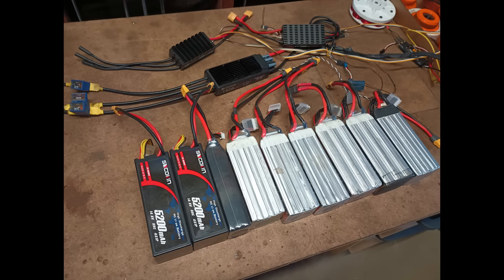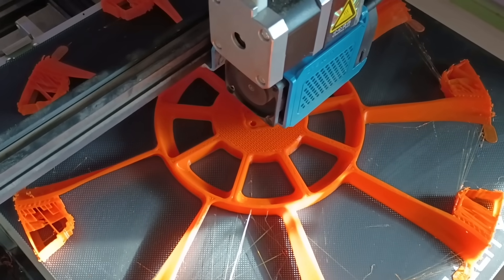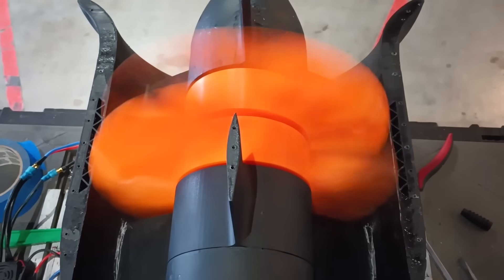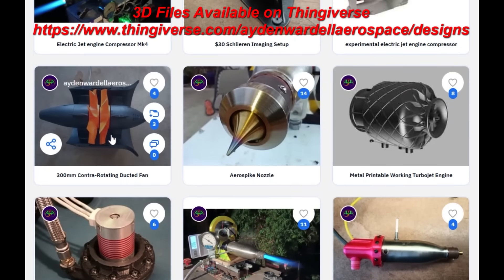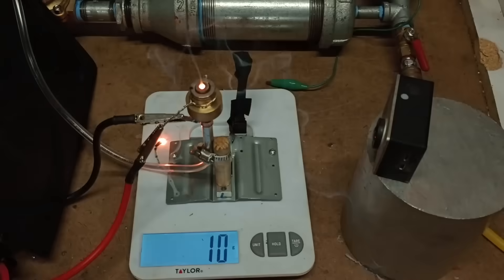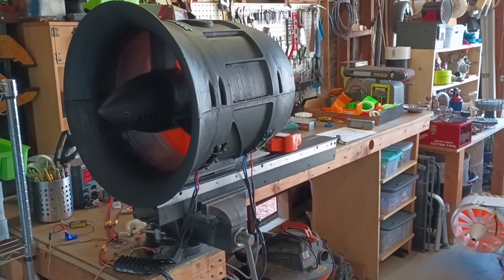Considering the power levels involved, I recommend that anyone who attempts to build this exercise extreme caution. I had to use most of my battery collection to power this beast of a thruster. Although I have run simulations and full speed tests, the greatest hazard is one or both rotors exploding and sending flying debris. Never stand directly to the side while operating and always wear safety goggles. Make sure all spinning parts are balanced to the best of your ability to avoid any excess vibration. 3D model files are available for free through a link in the description. This has been a fun project to work on between all of my engineering classes and other failed thruster attempts. I plan to continue optimizing this design for better efficiency, motor loading, and thermal endurance. Hopefully this thruster design can prove useful and be a step closer toward electric aviation.